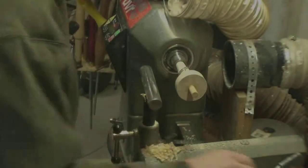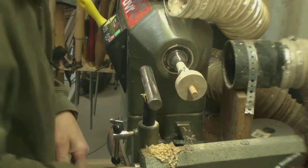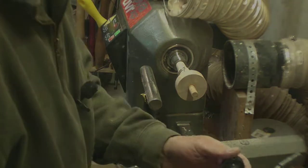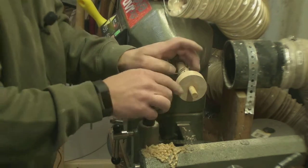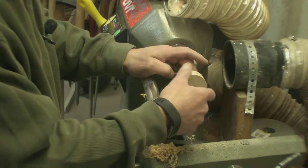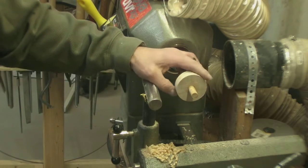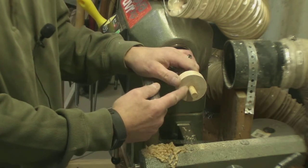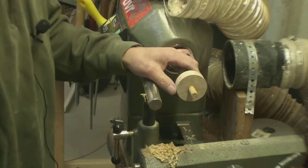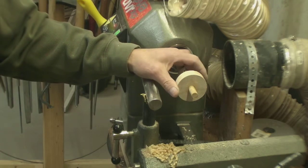All right. So it's time to get to the fun project which we started with, the whole purpose for making the collet. I'm going to make a little top. So as you see, when I make my blanks, I make the blanks with a round top piece. What I do is a simple hole saw, and I drill the blank, and end up with a quarter inch hole in the middle, enlarge that to a half inch, and then glue a half inch dowel inside of it. And that gives me exactly what I need to make my top.